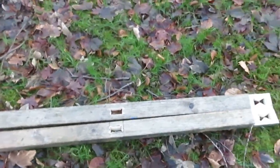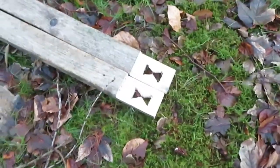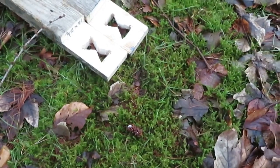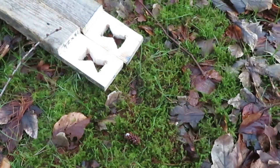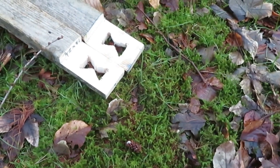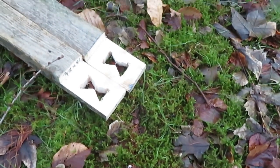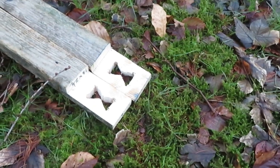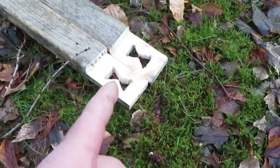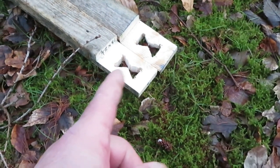If you decide to make a ridge pole, you'll make a lap joint. That wood is one and a half inches by two and a half inches — in real money it's 40mm by 60mm. You make a lap joint where it's going to join and that's where you start your measurements from. You'll put in your first hole and it will be exactly the same on each side.